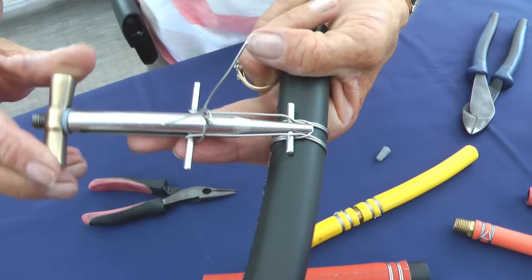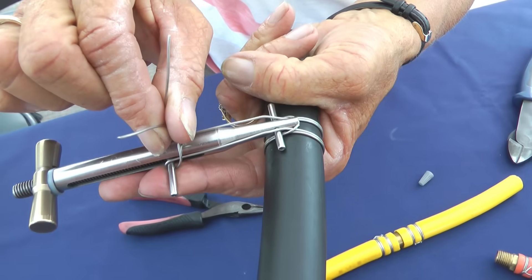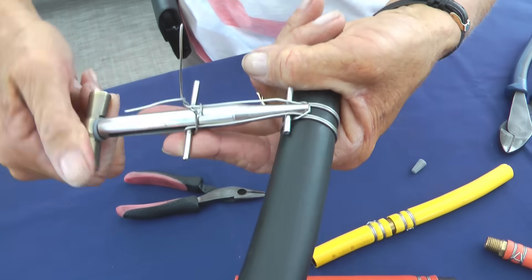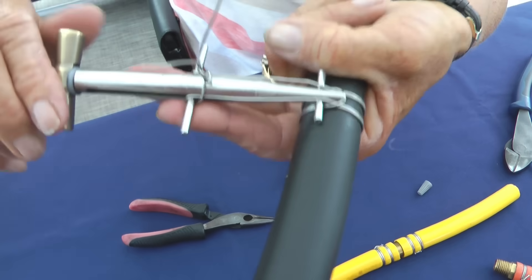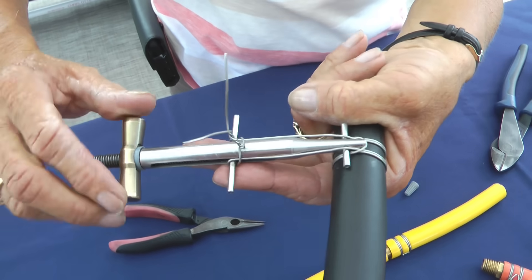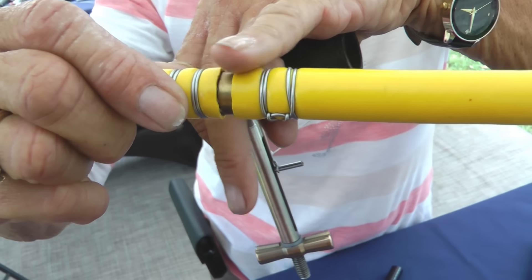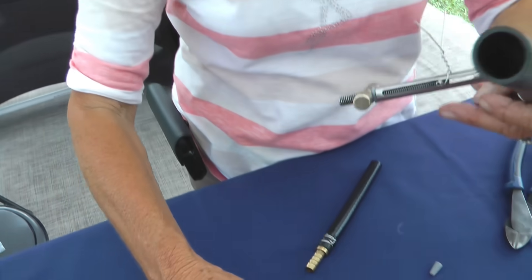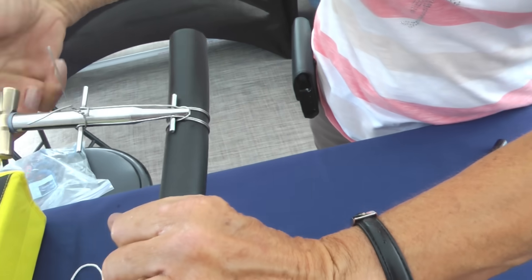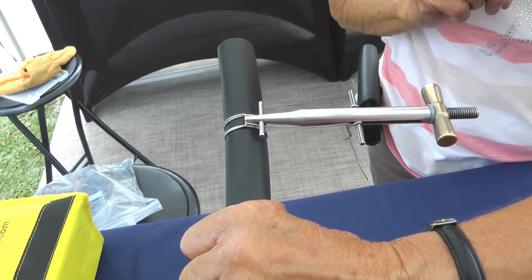Once you've got it where you want it, just start turning. I'm using stainless steel wire, so I'm pretty sure I'm not going to break it. As you start turning, eventually you'll feel the resistance as you turn into the fitting. On an application like this, you'll see that wire flush with the top of the product line because you're setting down into the barbs. When you get it where you want it, to lock it, just take your tool, rotate it 180 degrees over that cross wire, and you've locked your clamp.